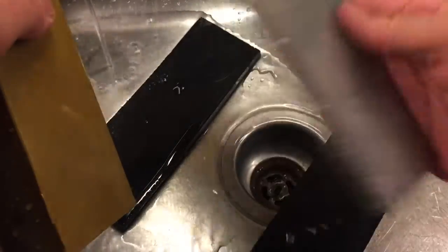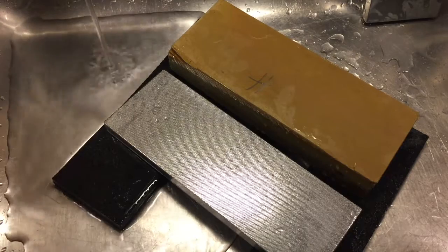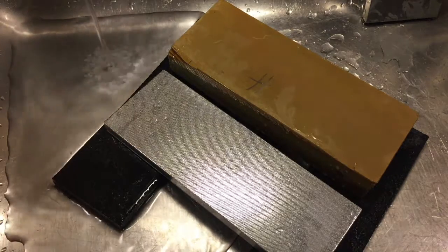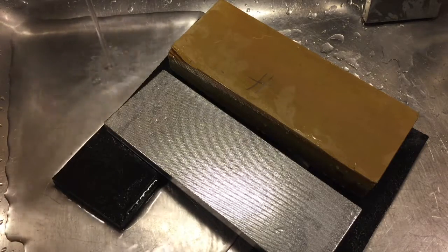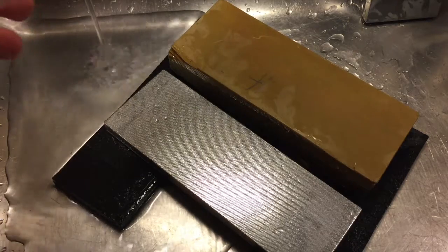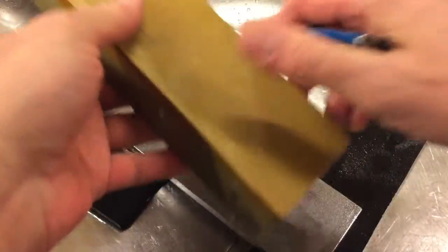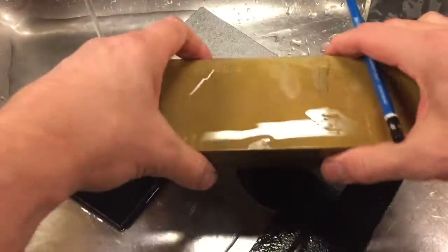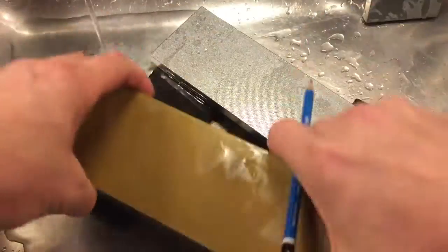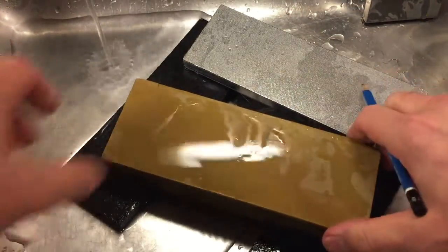The reason for having plates in varying degrees of wear is that when you start out lapping, you want as much bite as you can get. After that you don't need so much bite — you're just leveling and you don't need to be too aggressive. When I lap, I'll go and lap and watch the stone to see how it's leveling out.